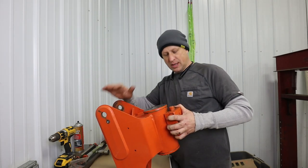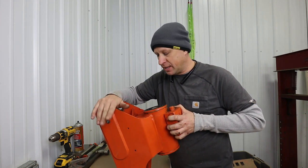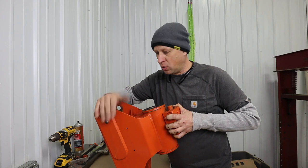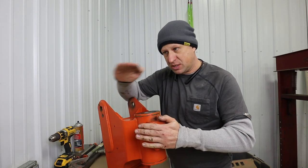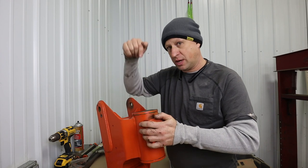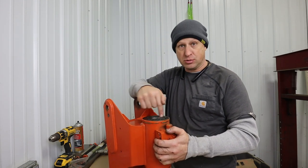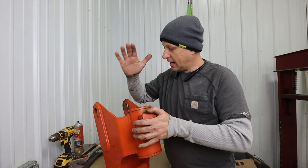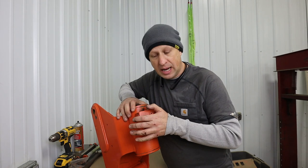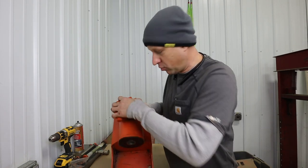There's three quarter inch hydraulic lines, and here it is. So if you get the pins out, then on the basket there are two pieces of metal. You can take that pivot bolt out, and then there's a bunch of cap screws that just go in the top to prevent it from rotating. So we're gonna get this thing torn down and try to rebuild it. Try is the operative word here.